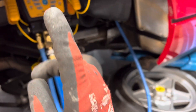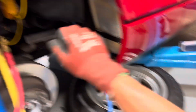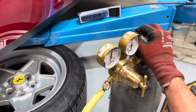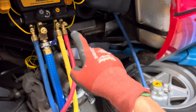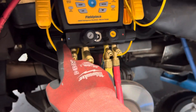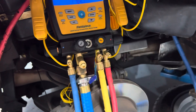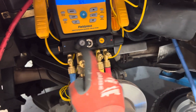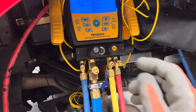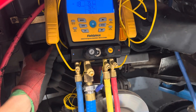I'm going to show you from the ground up. I have it closed right here. Nitrogen is on — so now we have nitrogen sitting in this yellow hose. Once I got down there I opened up the low side and I'm drawing both sides down to a vacuum, but everything is going to be drawn out through the low side while the dry nitrogen sweeps in from the high side.